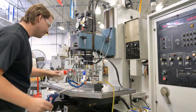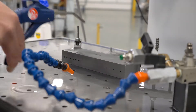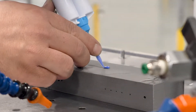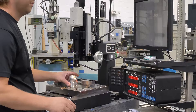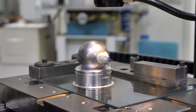At the end of the machining process, it's time to measure the notch dimensions. The notch cavity is carefully cleaned so that a metrology grade replication material can be applied to the surface. This replication material fills the notch cavity and is used to yield an accurate casting of the depth, width, and length of the EDM notch. The notch replica is then inspected on a calibrated video measurement system at high magnification to ensure that the correct dimensions were achieved during the EDM machining process.